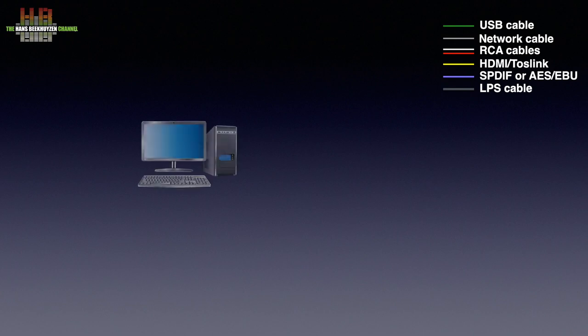Let's start with a computer that holds your music, preferably in one of the lossless formats like FLAC, Apple Lossless or AIFF. Then you need player software that is able to output a bit-perfect digital audio signal to a USB output. Some examples are JRiver Media Center, Audirvana and Roon, but there are many more. The computer will normally be connected over your network to the internet, so you can play music from quality streaming services like Tidal or Qobuz, or lower quality services like Spotify.